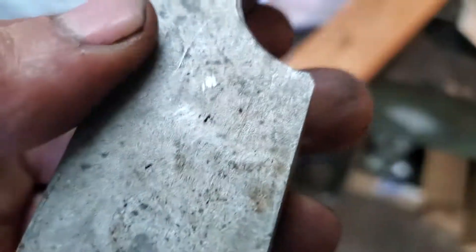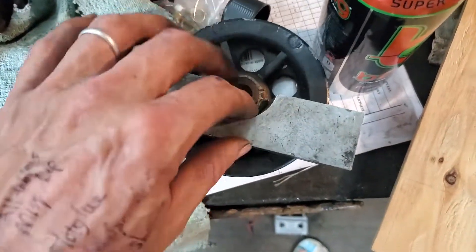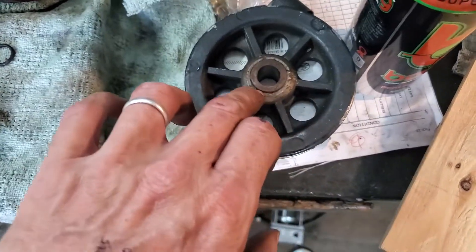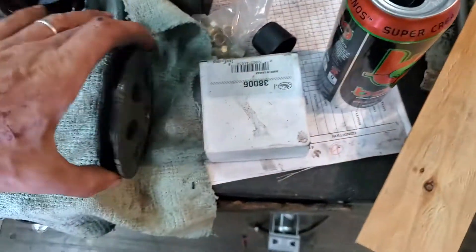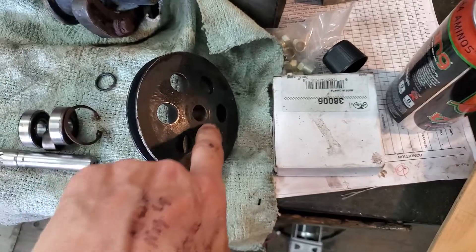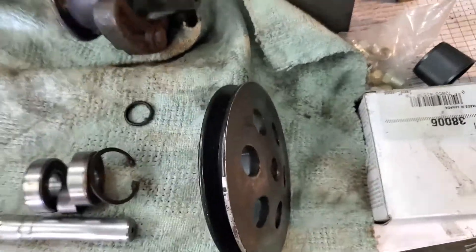It's really almost impossible to get anything in there - you can see how close it sits. You want to support this pulley as much as possible across the whole area. You're gonna have to try and get something right on this flange on the inside, which is very difficult. Most of the time you're just gonna have to support it on the press and press the pin down. I heat this up with a torch because if you crack it, it's a real pain. That is by far the most difficult part.